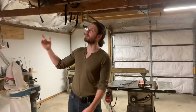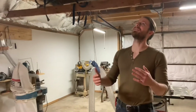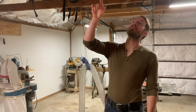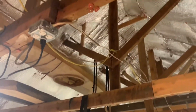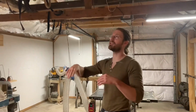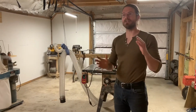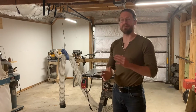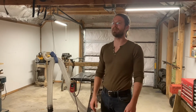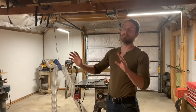Keep the height. Plus, I couldn't think of a place to store my boat, and so I knew I was going to have, isn't that pretty, you guys? To have a vaulted thing, and I couldn't think of how to get plywood up there. And how to, every single one of these trusses is hand built by someone not me, and they're all not uniform, and they all nail in weird, and so there's just no way to make the cuts clean. So I thought I'll just cover the insulation with radiant bubble wrap, which is useful anyway, and I had a bunch of it from sort of a redneck work tent I had in here before, and so I just put that up. That's what this is, radiant bubble wrap.